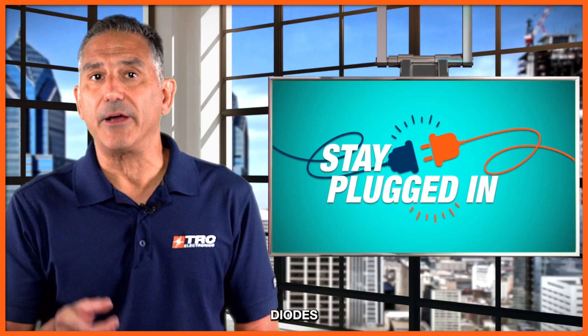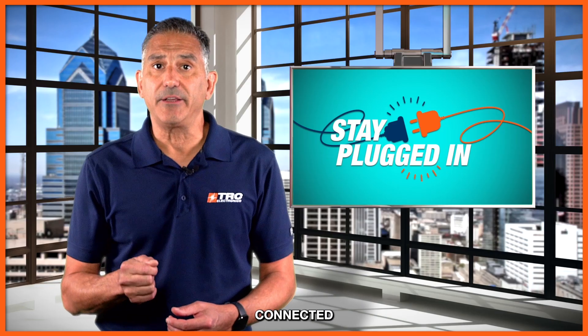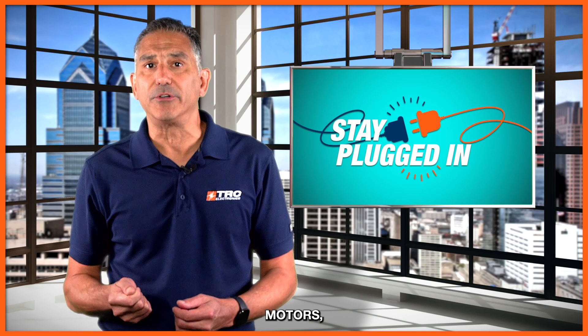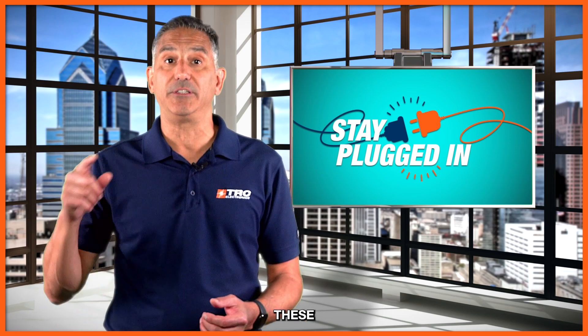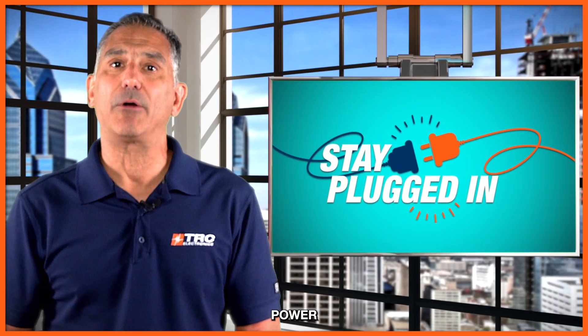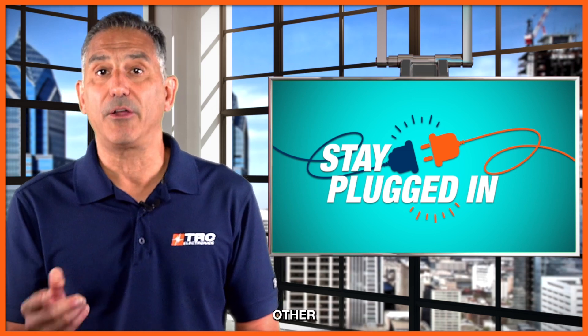As an extra precaution, we recommend that diodes are placed in a reverse bias configuration across each output, as shown in the picture. The reason for the diode configuration is to protect each output from going into a negative polarity that's over 0.7 volts, should one of the outputs be shut down. When connected to inductive loads such as motors, the energy from the motor during deceleration would also find a conduction path across these diodes.